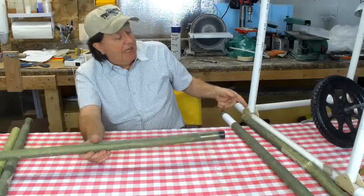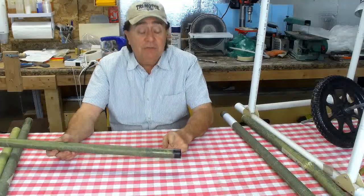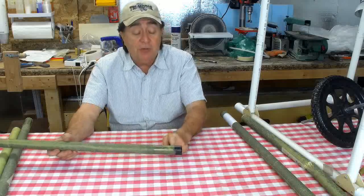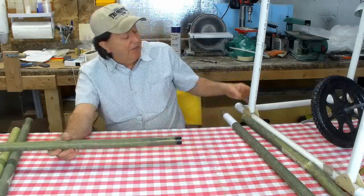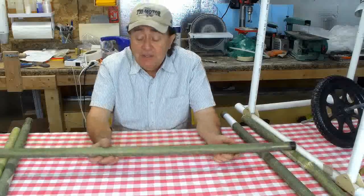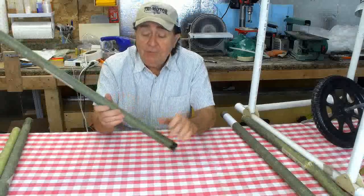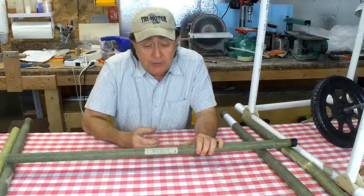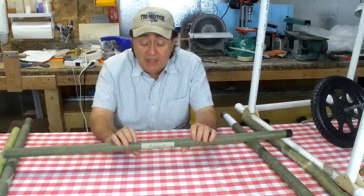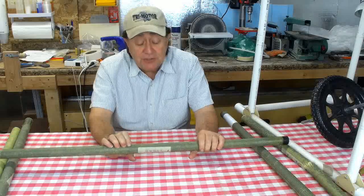Now here at the attachment points, there's going to be a little wood plug in here, and then a pultruded fiberglass piece of tubing through here that the bolt runs in, and that reinforces the area locally so we don't have failure at the attachment points. However, the local buckling is an issue. If you were to bump this on a landing, say with your helmet or your shoulder, you trip below, you bump into it, and it's going to collapse it. And as soon as you buckle it, the tubing's going to fail.